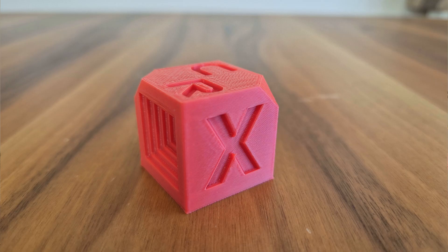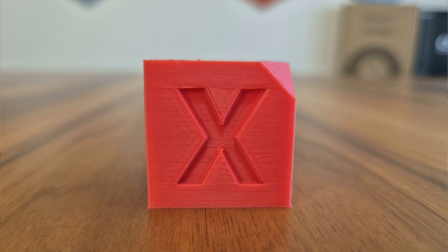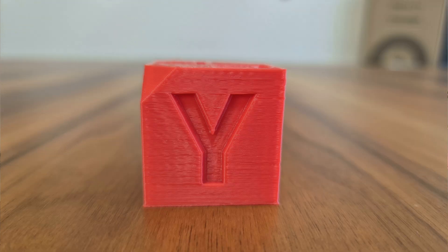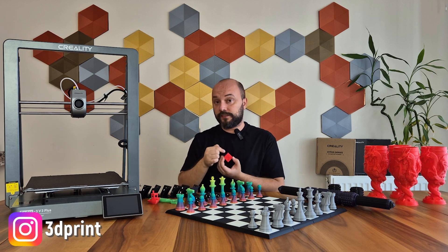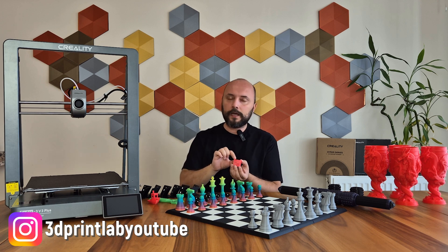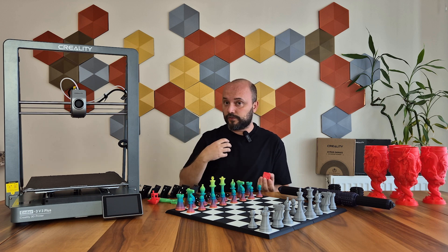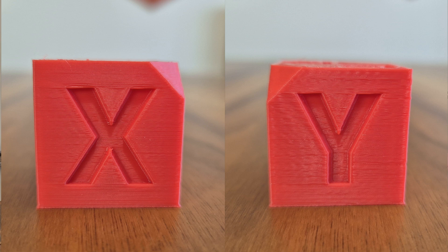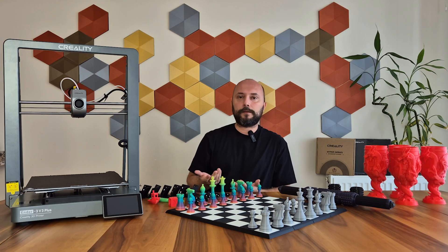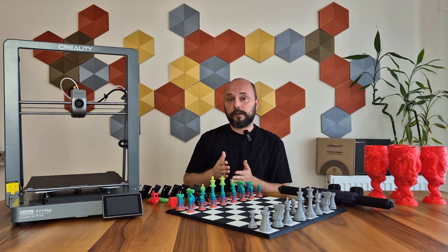When comparing the X-axis and Y-axis on the test cube, the X-axis is much smoother than the Y-axis. In the X direction, the print head provides fast movements in areas with indentations and protrusions, whereas in the Y direction, it is the bed that moves. So the printer gives much better results during sudden movements of the head, while vibration effects become slightly noticeable during sudden movements of the bed. As the bed size increases, this type of vibration can occur. Knowing this, I can position the parts where I want smoother results according to X-axis movements to achieve better outcomes.